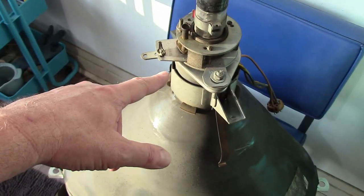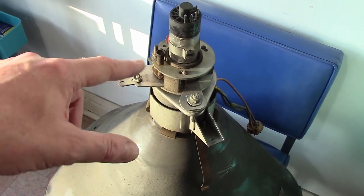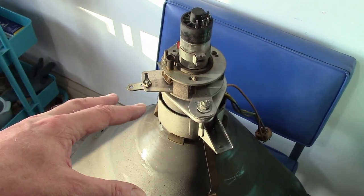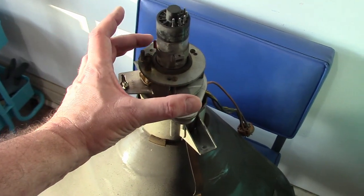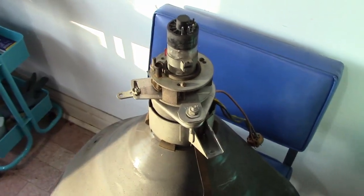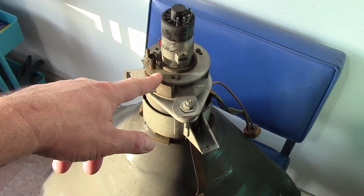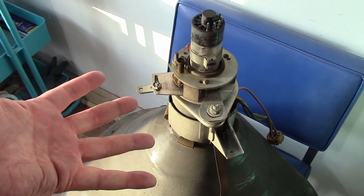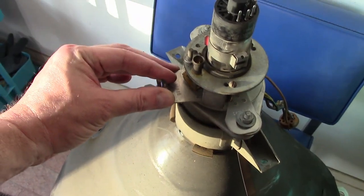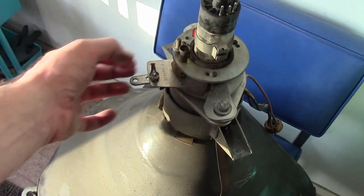Now, this assembly is interesting. This is a focus — not electrostatic focus, it's magnetic focus, but it doesn't use an electromagnet. This is another interesting crossover period. Earlier sets would have had a big coil around here with a couple wires going off to a rheostat to control the current through it, and that's how you would control the focus. This is a permanent magnet assembly. These are handy, these are worth scavenging, because if you come across a set that has a burned-out focus coil, you can pop this on. It's adjustable — you can loosen up this wing nut, and there's a metal plate with a movable magnet that somehow affects the magnetic field, and you can slide that around.